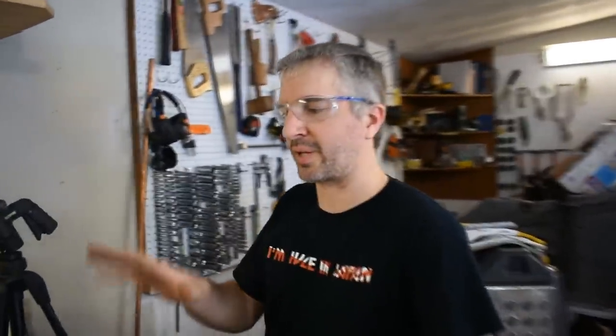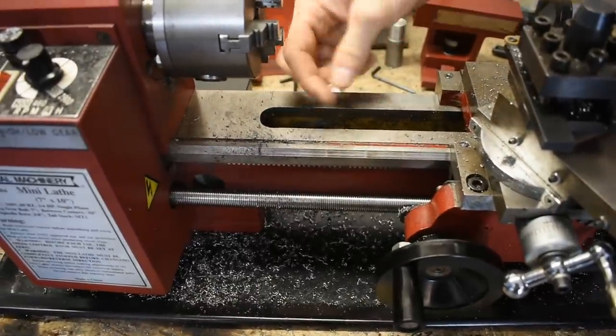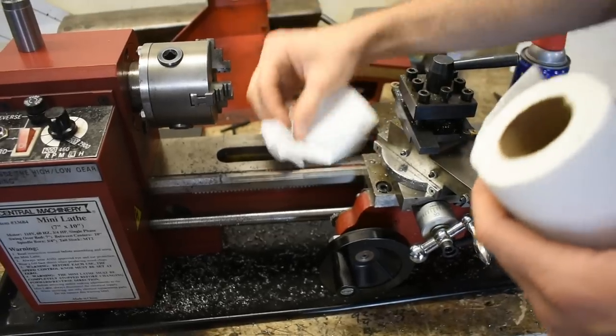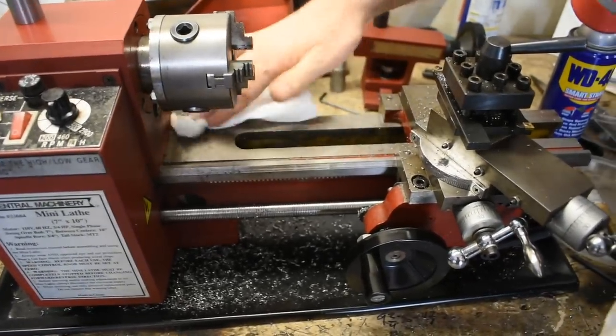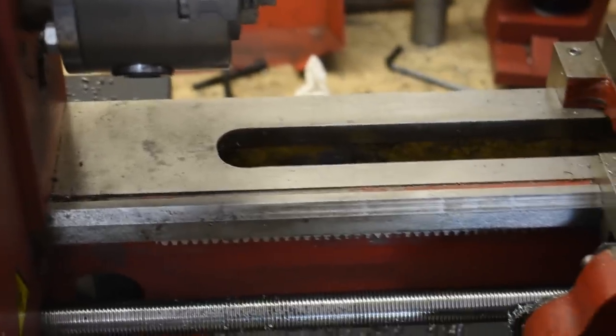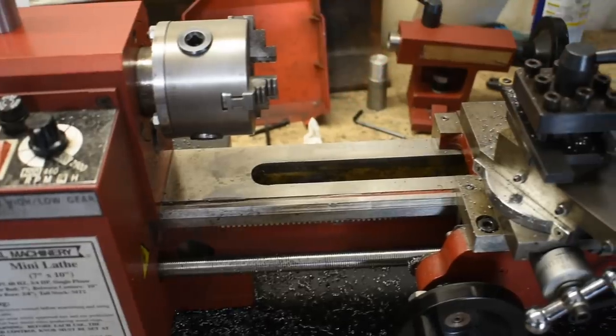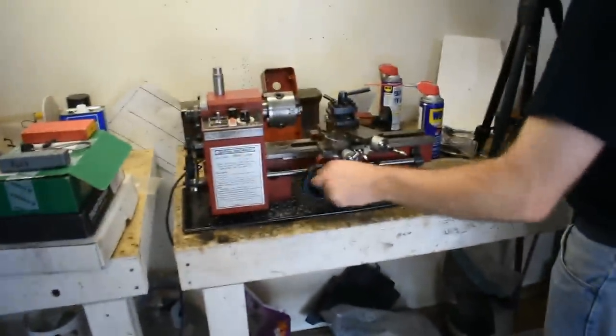He has great tech tips — that's where I learned a lot of my techniques until I got to Chirpy's workshop. The toilet paper is for cleaning swarf — it's all full of oil and sticking to everything. You just take a little bit of two-ply, and it just cleans all that garbage right up. Make sure to put oil back on after — ideally 30-weight SE non-detergent, though I only have WD-40 here. And that's it — nice and ready to go. So if you were wanting to learn how to use a lathe, I just learned how to sort of use a lathe.